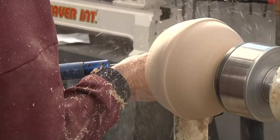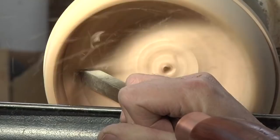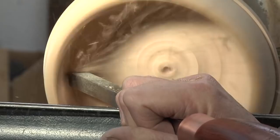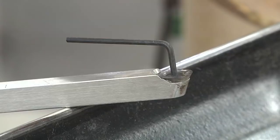Don't forget to measure for the bottom of the bowl. Back to the carbide cutter to remove the rest of the wood. Scrapers are a much easier way to shape a curve, although on a dry piece of maple burl — which has end grain going in all directions — you can end up with a lot of torn fiber. Rotating the cutter to a fresh sharp edge is a good method for cleaning up the surface. At this stage, take slow, light passes.